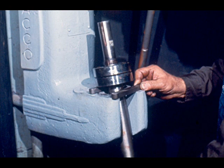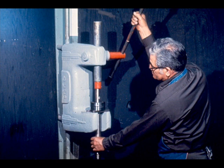The other two bearings — the two angular contact thrust bearings — are pressed off simultaneously. Again, position the parallel bars under the inner race of the bottom bearing, like this. Since these bearings are in a duplex mounting, we press both of them off the shaft at the same time. Pay very close attention to the way the bearings are mounted, and check them against the manufacturer's drawings. For instance, these bearings are mounted back to back. Remember, though, that this may vary from one piece of equipment to another, depending on how the bearings are mounted.